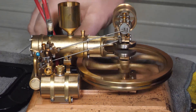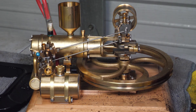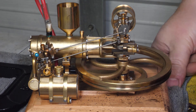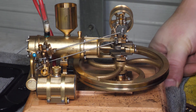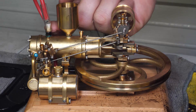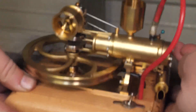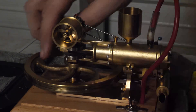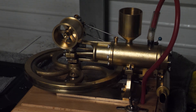Nope, it's arcing right down the back side here. I have to go do some work on this engine and get this insulation better. I've checked the ground on this engine before so it shouldn't be a ground issue that has suddenly developed, but we'll look again. That arcing on the outside of the insulator has nothing to do with the grounding of the engine and everything to do with the insulation and the plug, so I guess that'll be the project for the R18.